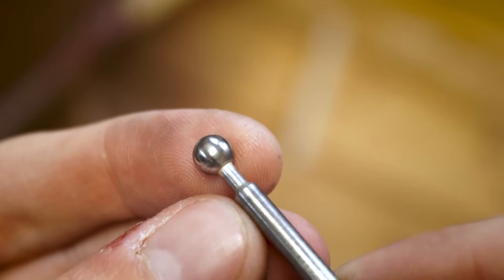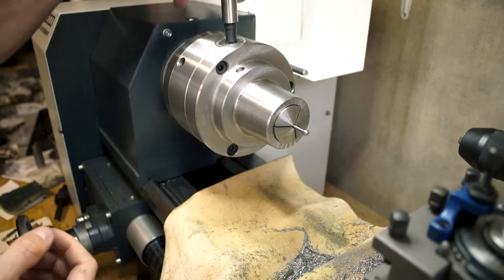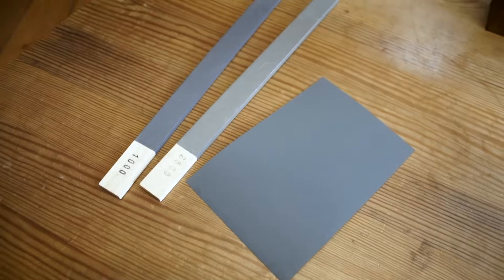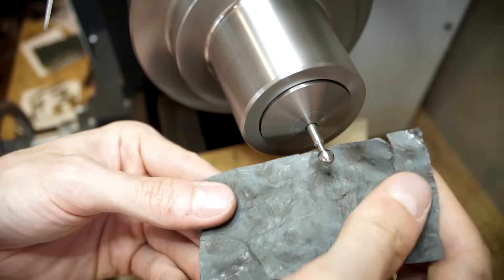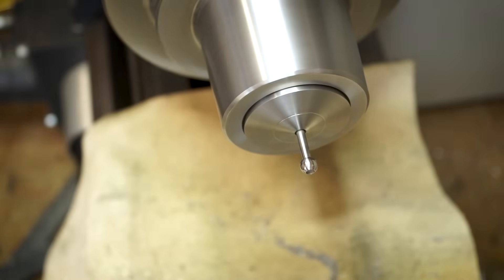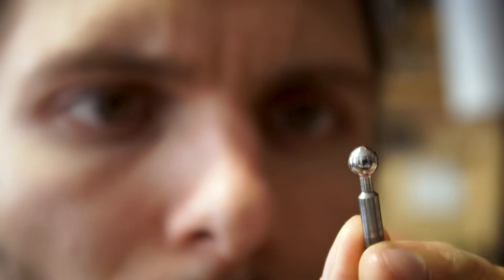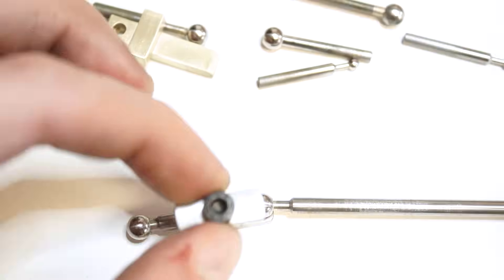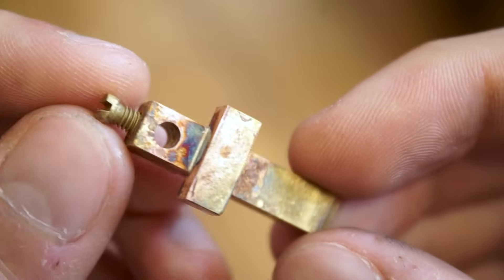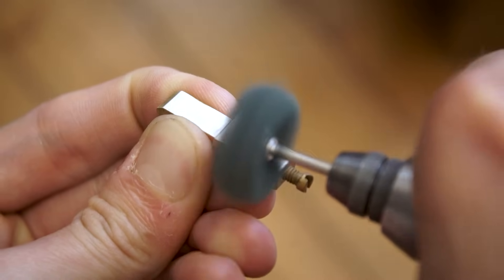Like that, it's probably already fine for any practical purposes, but especially for commissioned pieces I usually give the balls a proper polish. This works best if you spin it with a cordless drill or a lathe. Then I use very soft sandpaper, 1000 to 3000 grit, until I achieve a mirror finish. This shouldn't distort the ball by any measurable amount and the results just look awesome. For any non-round assemblies, like the joint blocks of single ball and socket joints, or hip and shoulder pieces, I recommend these scotch brite wheels for a Dremel tool to clean it up.